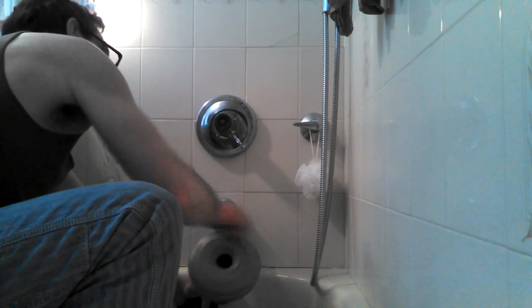So I have it stuck in that pop-up hole, and I'm just turning and turning and letting it feed itself in. Because as the pipe twists and turns, the snake is designed to kind of screw itself through there. You can't just jam it straight in. It's got to go on a rotation as it's getting pushed in there. That's basically the theory behind the snake. So I'm going and I'm going. We want to go a little further than we did last time, so I'm going to give it a bunch of turns.